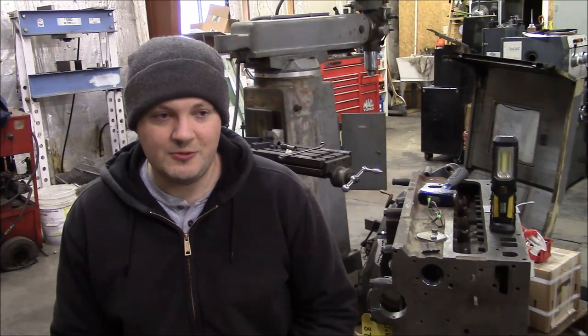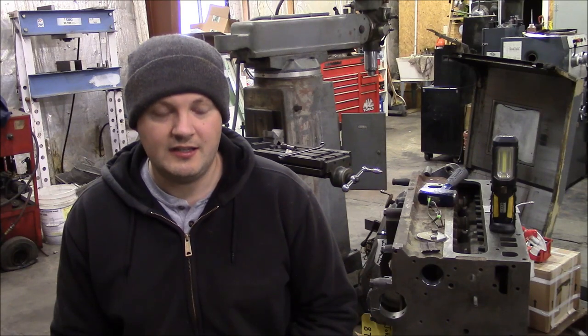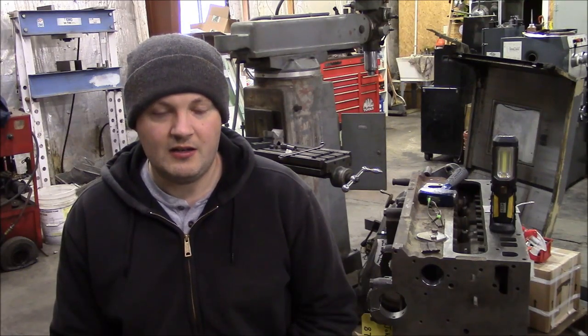If the damage is too bad, they can weld the crankshaft. I've had that done successfully before. It's really not a big deal. A good automotive machine shop can weld and straighten and grind a crankshaft. The thing about welding a crankshaft, though, is that all the journals have to be ground after it's been welded.